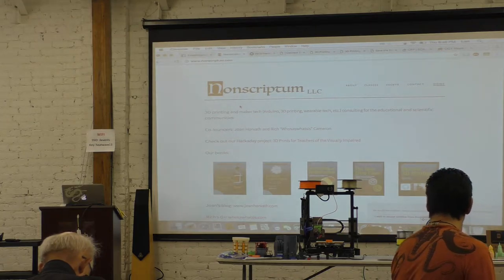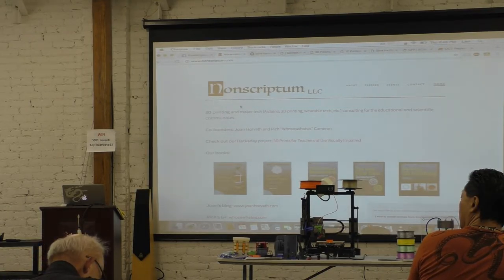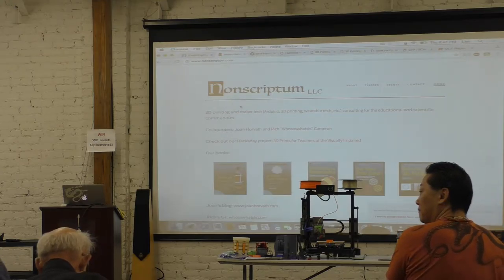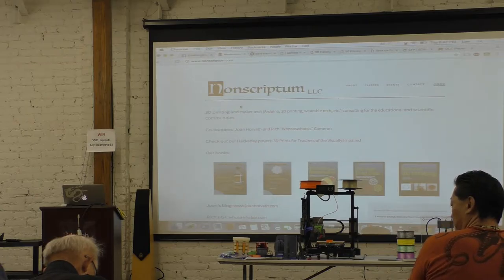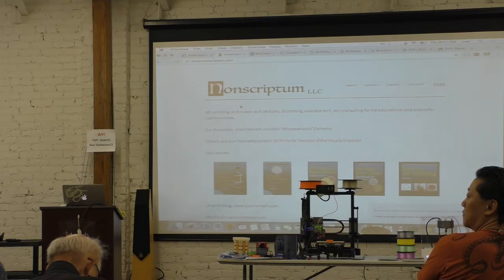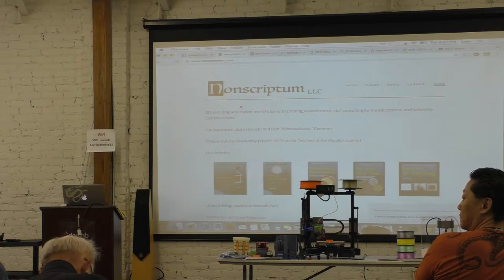One of the things I thought about doing with 3D printing was to make molds for chocolates, ice cubes, or similar. We tried that for a chocolate space shuttle to disastrous results — the layers on the outside trapped food particles, so it was impossible to keep it food-grade safe. You'd need to print a new one every time. If you want to make food molds, I would print a positive, then make a silicone mold from it. Reynolds Advanced Materials in Burbank has a million types of silicone and even a class on molding. I actually had a customer this week — we 3D printed a positive of a gorilla head that he was going to give out for Halloween as chocolate.